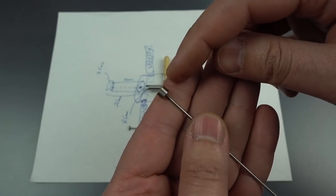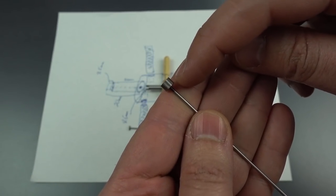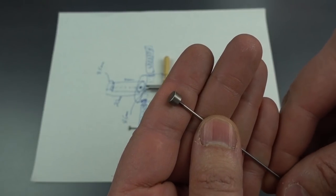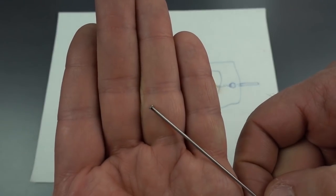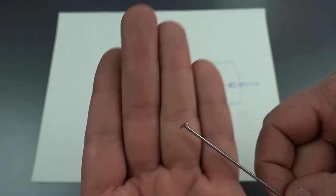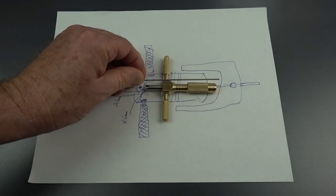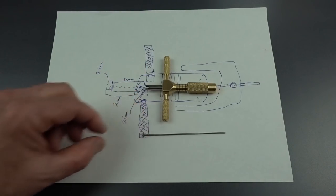We machined this little knob on the end down to about 20/1000ths of an inch, about 0.5 millimeter, and then sanded off the ends, used files to get it to the final shape, and frankly, I am very happy with the final result. I think this is going to work well. One piece of metal, that's much less chance of any kind of shearing or anything. Plus, the length works in our favor. And it's the right diameter. Yep. It's the best of all worlds.